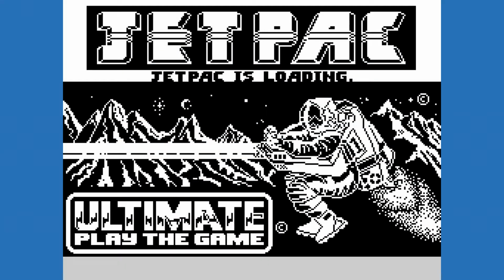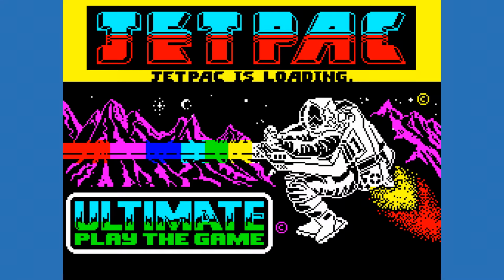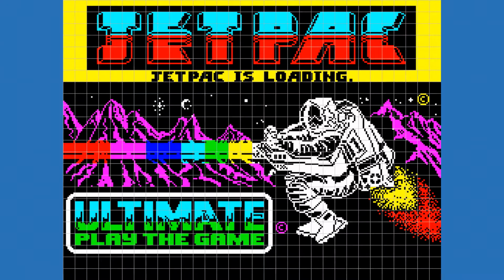For each 8x8 pixel grid square on the screen, we can set the paper and the ink colour, which defines the 2 colours each of those bits represents. Take our black and white image, and we can now see what it looks like with colour. And we can very clearly see where these grid lines are coming in.